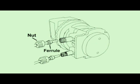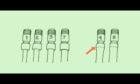The suction and discharge lines are installed to the pump tube fittings with a compression type seal consisting of the connecting nut and ferrule. The beveled end of the ferrule faces the tube fitting, and the suction and discharge lines should bottom into the tube fitting. The connecting nut is secured into the fitting finger-tight only and not tightened with pliers or wrapped with thread seal tape. Pliers or thread seal tape should not be used because the pump tube fitting is secured to the tube material by an internal seal consisting of a crimped brass collar, and on some of the tubes the brass collar is under a rubber collar. Using pliers will break the internal seal and cause the tube to leak, and using thread seal tape will interfere with the seat between the connecting nut and ferrule.